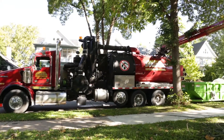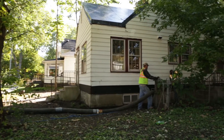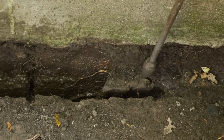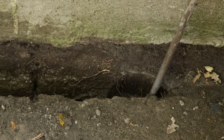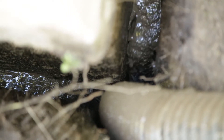So we came up with the concept of using a hydro vac truck to create a trench with minimal damage. What they do is use high-pressure water to slice the soil, which creates a mud slurry that they're able to vacuum out like a large shop vac.